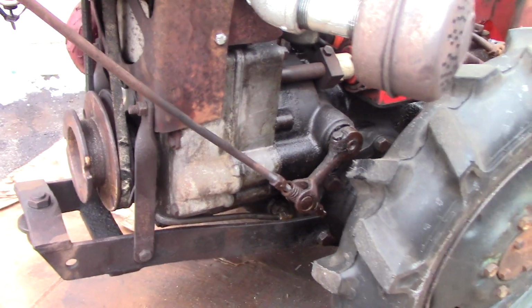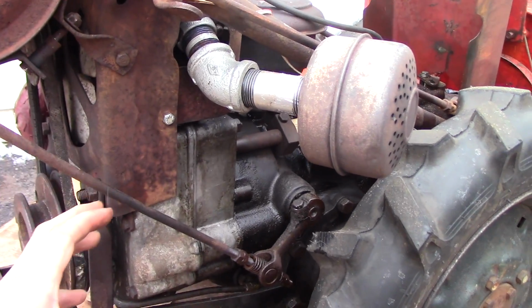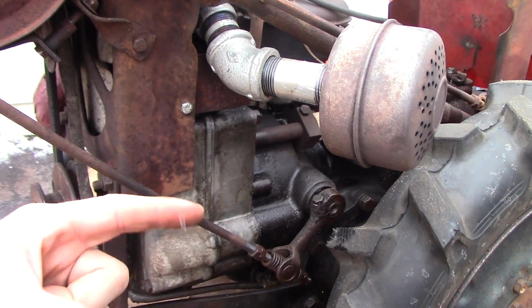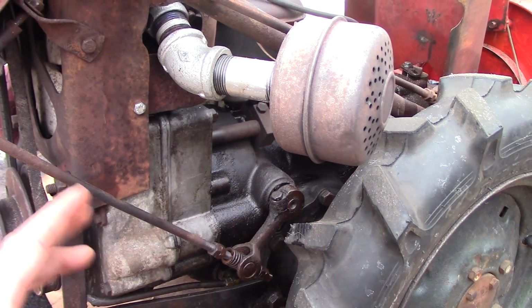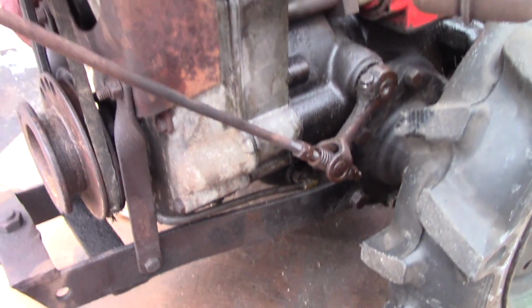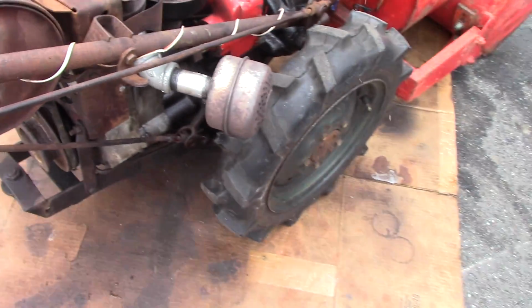There's a lot of interesting things, so you might hear me say this a lot, but on these engines, I could be wrong about this, or I could be saying it the wrong way, but I forget what the actual terminology is, the crankshaft in this thing is basically two big discs with a pin in between, and as a result, it's balanced, which is nice, but the crankshaft almost acts as the flywheel in a way, because you can see this is the starter cup. There's not really a lot of weight here. So it's kind of interesting.